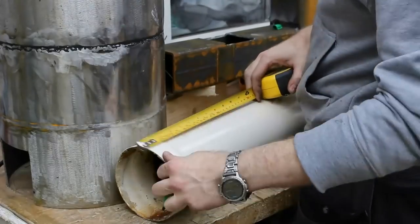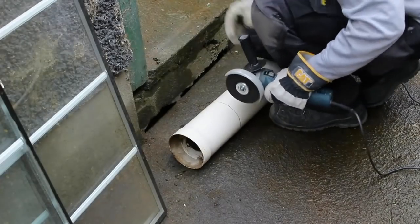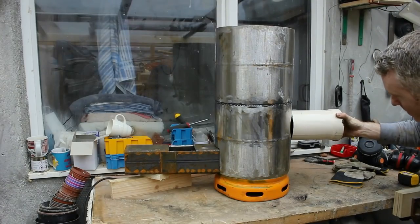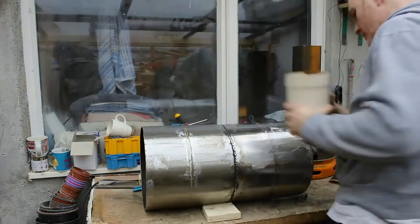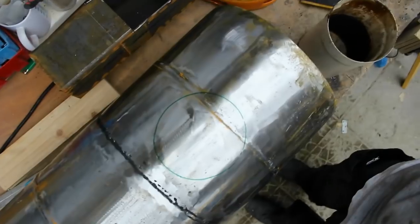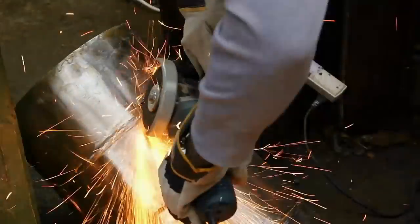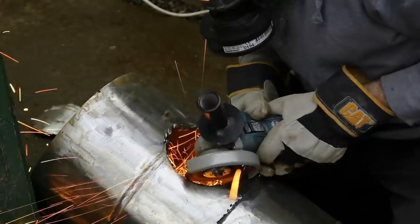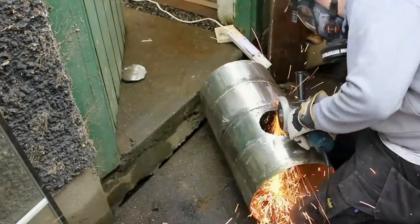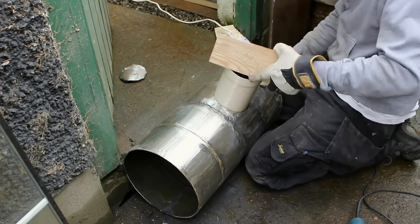I take a section of chimney flue that will be welded permanently into the back, so it doesn't need to be short. I measure it out, mark it off and then cut it. Determining where it goes, I decided to go just above the inlet tube. I lay the cylinders on their side, put the piece of flue on top and measure it out as accurately as I can by eye, leaving it a little bit tight so when I cut the hole it will fit in nicely. Cutting it with the grinder was quite difficult and took more than one attempt — every time I cut it and checked it, it was still far too tight so I had to take a little bit off the inside each time.